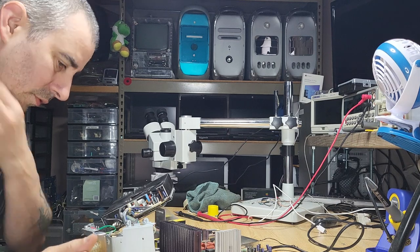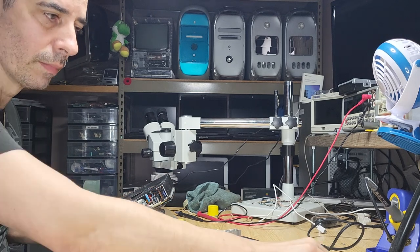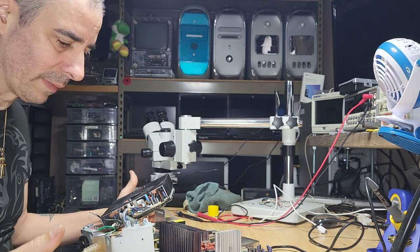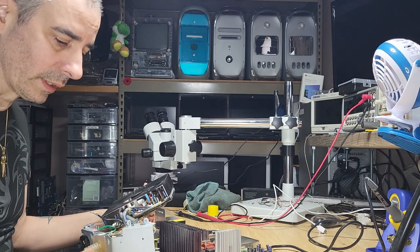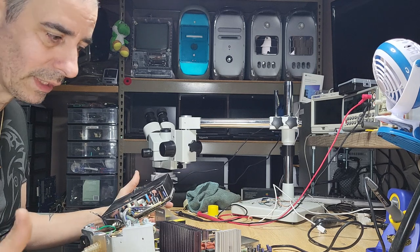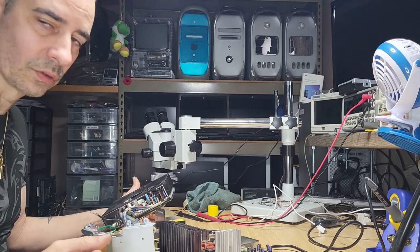Just like I said in an earlier video, I did work on the 17-inch CRT monitor from Apple, the blue and white one. I finally got the flyback for it. Sadly enough, I found out later that I had a bit of an issue with the picture itself. It was firing up just fine until roughly 10-15 minutes later, when it started to go super dark.